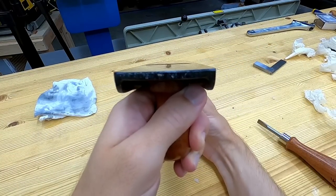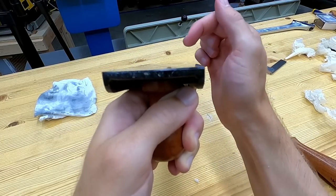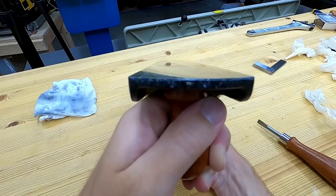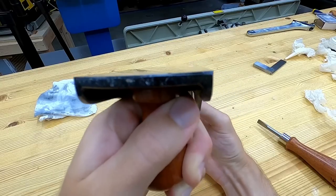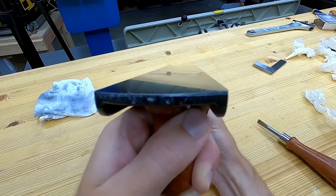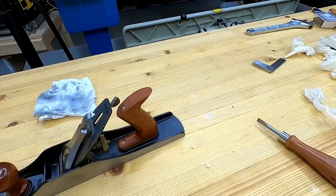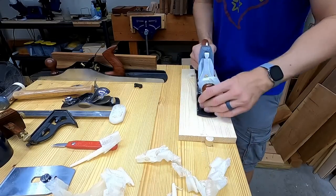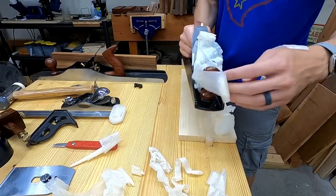Now with the blade in the plane the whole blade is sticking out way too far, so I'm going to back it off. As I back it off I notice I can only see the blade sticking out on the right and not at all on the left, so I'm going to push that adjustment lever towards the high side. When I do that I don't see the blade at all, so I turn the wheel so the blade will stick out further — that looks pretty even to me, left to right. If you need to, you can check by planing the edge of a board to make sure the left side is not taking off more than the right. If you're new to hand planes, please be aware that these are final thin shavings — if you tried to flatten a board with that light of a shaving it would take you all day. All right, thanks guys, I hope this video was helpful and I'll see y'all in the next one.